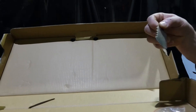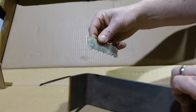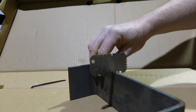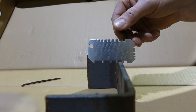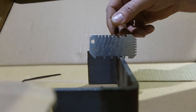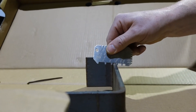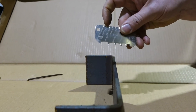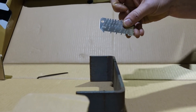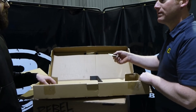Let's try that out on the piece of steel we're going to weld. It's a real simple device to use — you just take your material and try to find the thickness. This one's a tight fit because there's a little mill scale on the material, but basically this is telling us we're dealing with quarter-inch material. If you go to the 5/16th side, it's slightly bigger. So you've got 24 gauge all the way up to half-inch material thickness. It is nice because when you're setting the thickness on SmartMIG, there's no guesswork — we try to take it out of there.